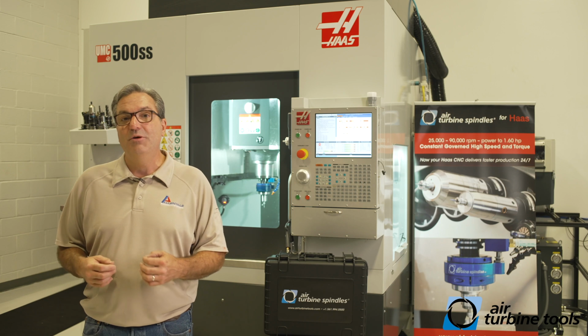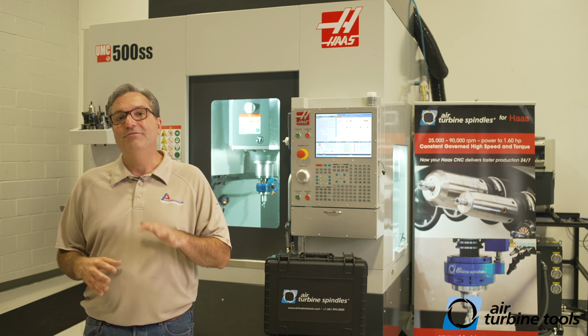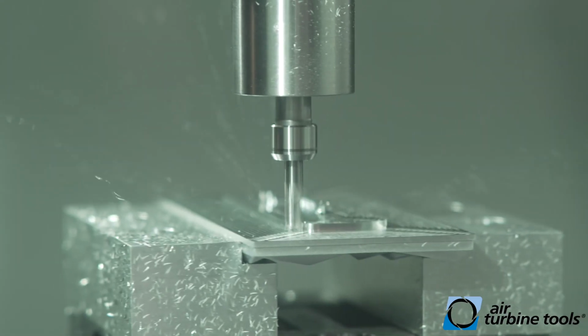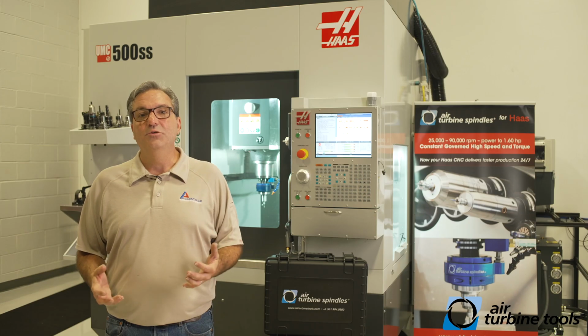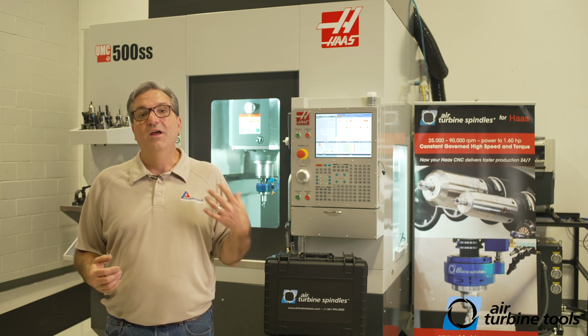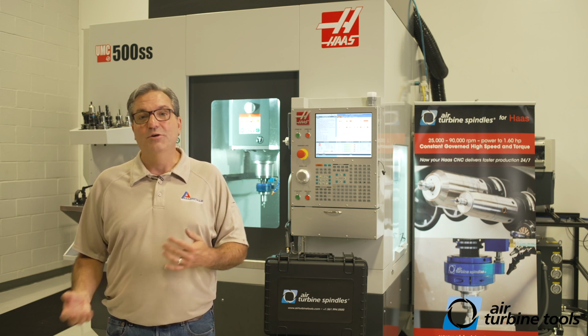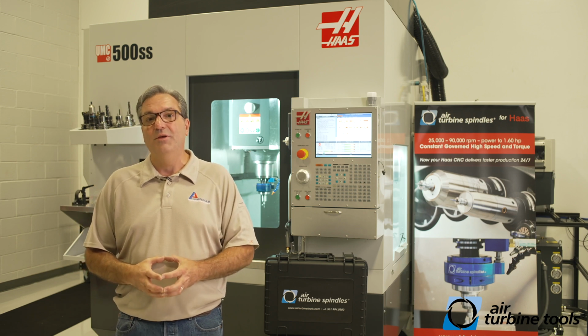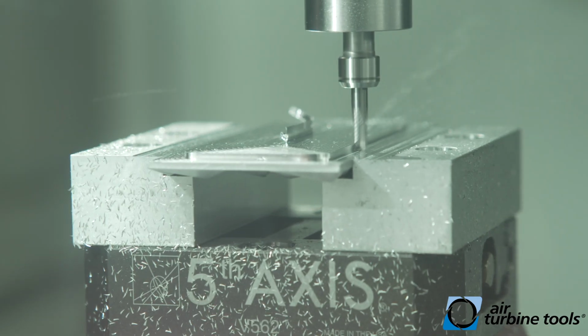This particular job that we're running today, I have 5 Air Turbine Spindles all set up in the carousel of the UMC 500 SS. The Air Turbine Spindles let us run at a continuous duty cycle 24/7 at 40, 50, or 65,000 RPM. That's a big increase from the 12,000 RPM that the HAAS Spindle comes standard.